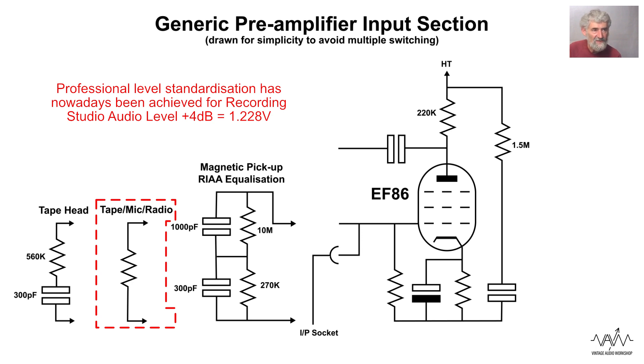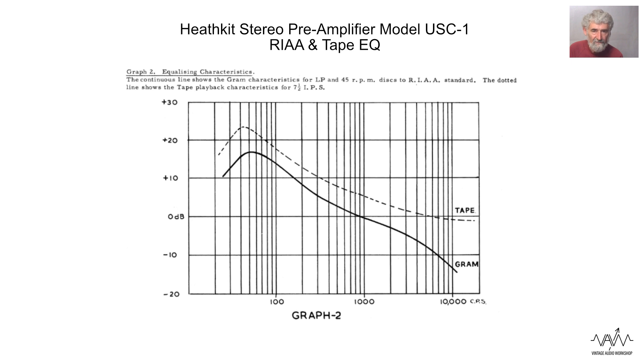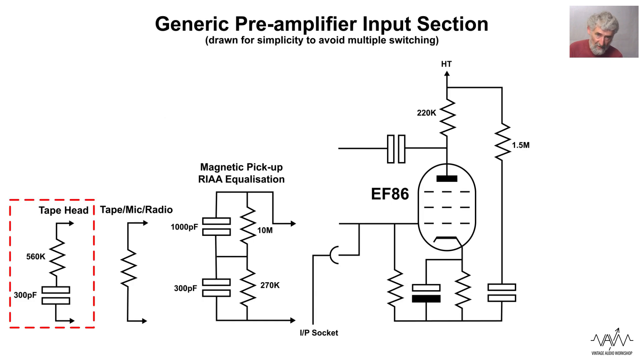For tape head, you have maximum bass boost and a great deal of treble cut, partly because there is pre-emphasis in the recording on tape - as indeed there is on records with the RIAA characteristic. In both cases that's because the medium has an increasing amount of noise with increasing frequency. But also the way a tape operates, even if you have a flat recording, it's all bass boost and a great deal of treble cut, and the simple circuit there provides the equalization.